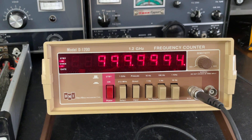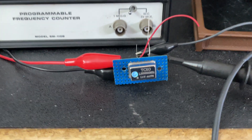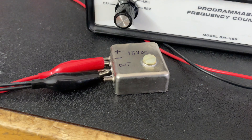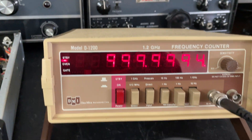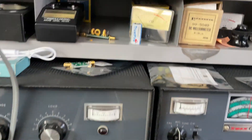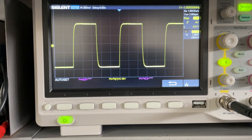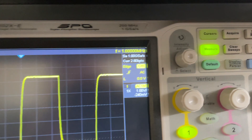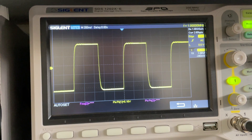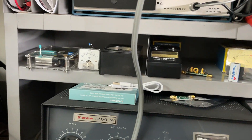I don't know for sure if this frequency counter is 100% accurate, and I don't know if the reference is either, but I know it's closer than the old one. The waveform is a square wave and it looks pretty nice — about 5.16 volts, very steady. My frequency meter says it's exactly 1.0 megahertz, and it's a nice looking square wave.